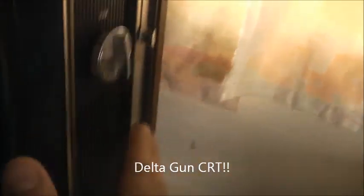Looking closely at that CRT. Oh, that's a black matrix. I've never seen a CRT like that. Instead of the rectangular red, green, blue pixels, it's got circular pixels like an old black and white CRT. I've never seen that. Very solid sounding tube. I'm going to have to do some lubricating, some checks with the ESR meter before we go powering this thing up.